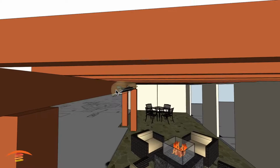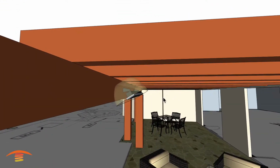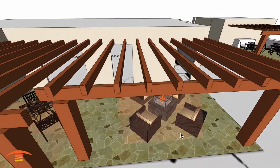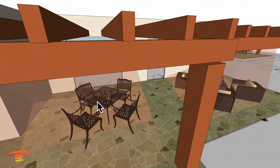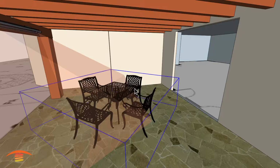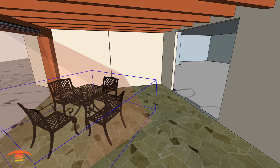But anyways, so this is the 6 inches of clearance on this beam application. Now, if you looked at the footprint of heat with this application, let me just turn off that clearance issue here, your footprint of heat is okay for the seating area that's right around here, also the seating area that's on this side here. Now, this actually might be, according to the image I saw, a little bit pushed in closer to the side here.